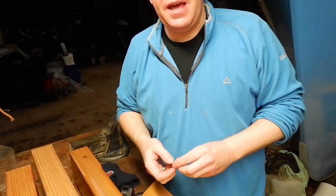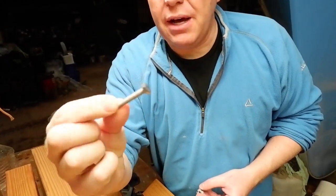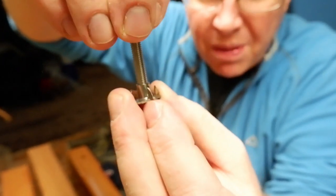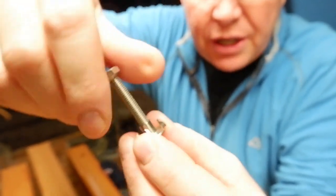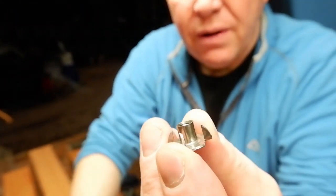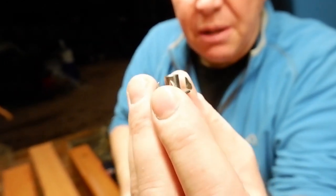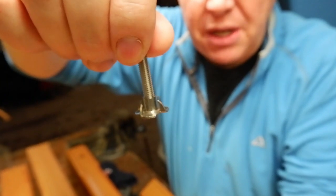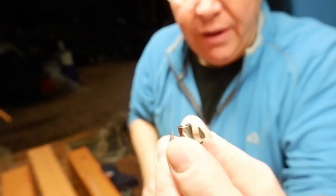Right boys and girls, how did I fit the hydraulic tank down? It was simply just wee 6mm bolts, 35mm in length. These wee bad boys are the bee's knees. What happens is when you put your bolt on and do it tight, these drag up into the plywood and grip it with the barbs on the end. The barbs stick into the plywood and it's the opposite thread of what the bolt is — it grips tight. The hydraulic tank has 6 of these in there and she ain't gonna move. That is how I fastened the hydraulic tank.